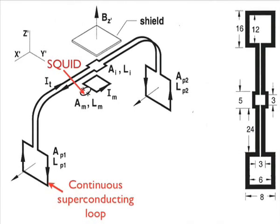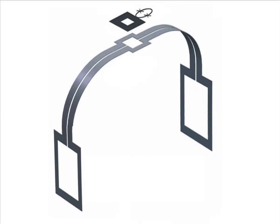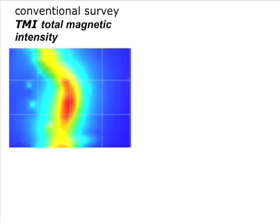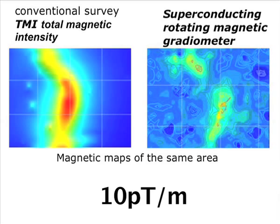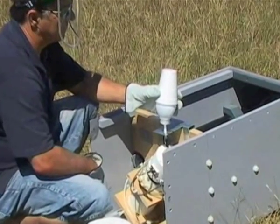Here is a great example where high-current, high-Tc coated conductors can play a decisive role in developing ultra-sensitive magnetic sensors. The gradient sensor is made from a high-temperature superconducting quantum interference device — a SQUID — operating in liquid nitrogen, coupled with a superconducting flux transformer made from a patented IPCO coated conductor. Magnetic tensor gradiometry offers a way to improve source localization from a moving platform; the desired sensitivity of the magnetic tensor components should be approximately 10 picotesla per meter. The sensor system uses rotating magnetic gradiometers to take measurements about three separate axes, enabling visualization of the depth, size, and shape of a deposit. Such an experimental system is cooled by liquid nitrogen and is ready for takeoff.